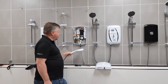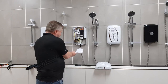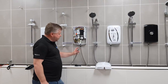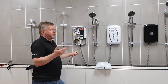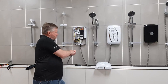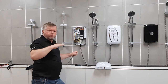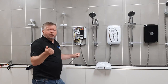Power's off. I'm just going to take the head off the hose, and all I'm going to do is use a quick thumb or finger test — just put a restriction on the hose. What this will do, if we have got pressure there but it's just not getting to the shower, is stop the flow coming out of the outlet, and this flag will actually start to lift. If it lifts, we know we're on the cusp of low pressure and we should be on the main system. If it didn't lift, we would be on a gravity system.